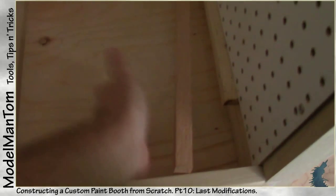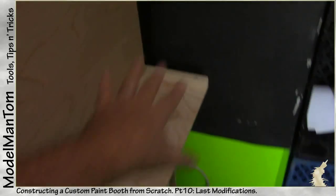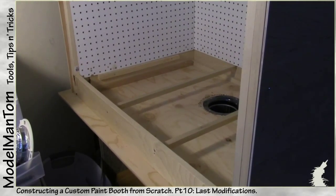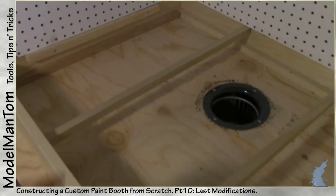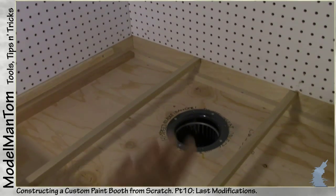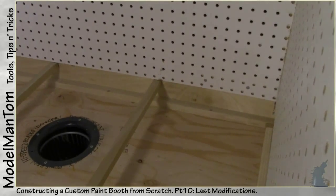Before I install the fan I just got to fit these guys into place, and after that's done I'll pull these off and give a much nicer and cleaner look. Just a few minutes later the new internal braces are around the bottom, so I'll have to lift it up, put the filter in, set it back down. One inch clearance should be just about perfect.